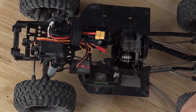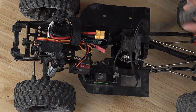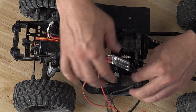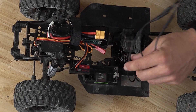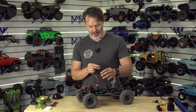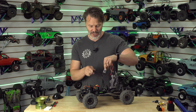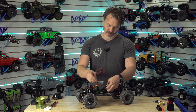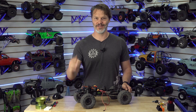I hope that at least explains a little bit about wires and wire sizes and wire lengths and all the different things that can happen in a rig. The biggest takeaway: just make sure your rig's not running hot. And if you're finding that your wires are getting really hot on a rig, then you probably need to upsize. And if you can't upsize, maybe you can shorten it, because those are the two biggest ways to reduce heat losses — bigger wires and shorter wires. If you do have any further questions, leave your comments down below. We'll do our best to get to them. As always, thanks for tuning in. Have a great day.